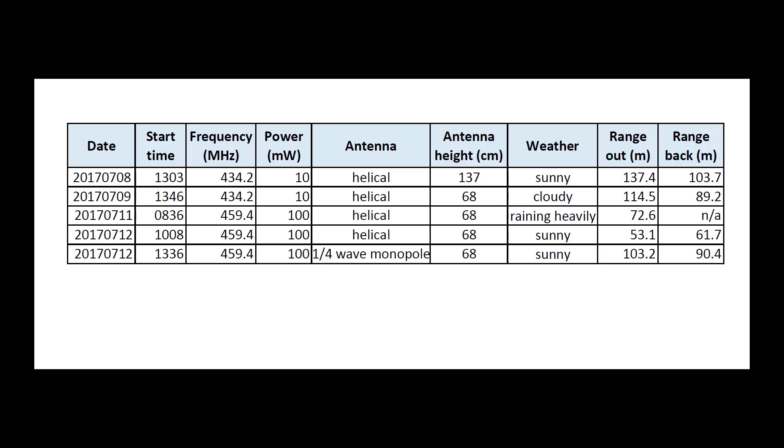The conclusion I reach is that if you want to use these HC12s to send data at 9600 baud over a radio link, that's fine so long as the range is 50 meters or less. But anything longer is likely to be unreliable. This figure bears no relation to the claimed range of 600 meters or one mile mentioned in the literature. The low range may be a function of the antenna being very close to the ground — on top of a mountain, perhaps we'd get a longer range.